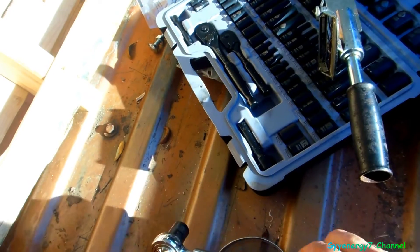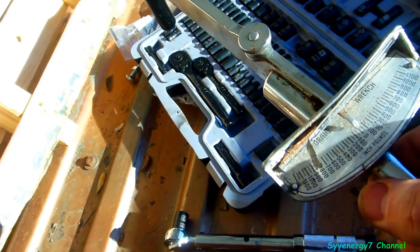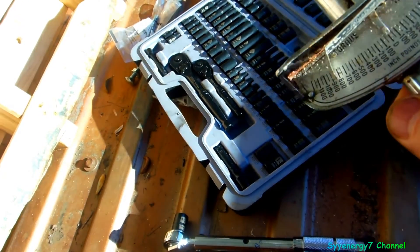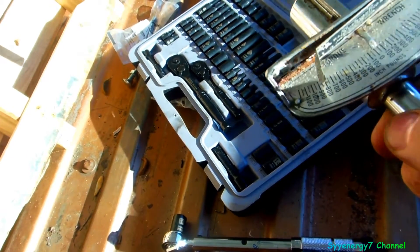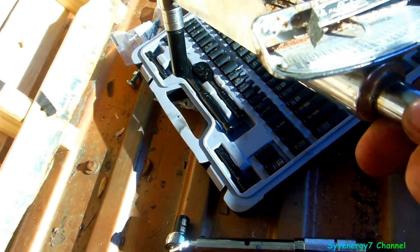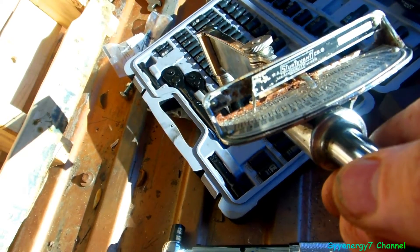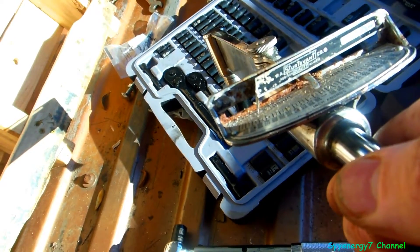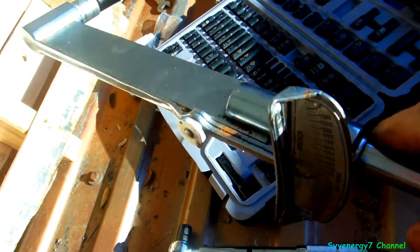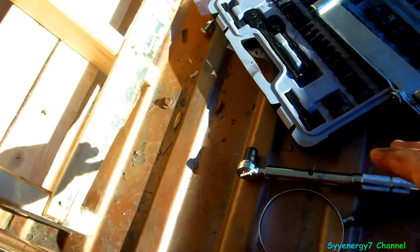As I started using it, I went back to my old 40-year-old inch-pound beam-style wrench, which is actually a good one — a Craftsman or something. To deal with this one, it always works fine, there's no problem with it. It has an adjustable pointer on it; the beam style always works accurately. So I figured I've got to find a way to check this click-style thing.